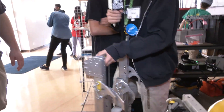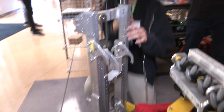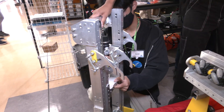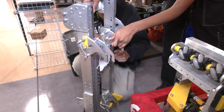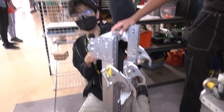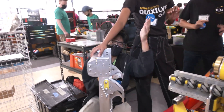With a single carriage, it would allow the robot to push all the way up and all the way down — eventually going all the way up into the mid-rung. Then we do what's called a double ratchet, going from the mid-rung into our first set of hooks here.